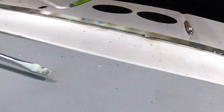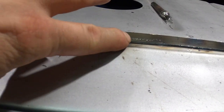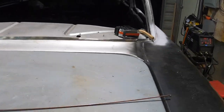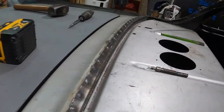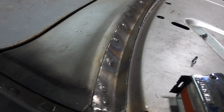Over here, it exploded the weld, and the galvanizing was coming out. So I stopped. I didn't want this all over the place, so I've got to fix that tomorrow. It's getting too late to do it tonight. But I opened up the holes with our drill thing right there, and we just MIG'd them in. So I'll have to sand a little bit more, but I'm confident that it's really in good now, all right?